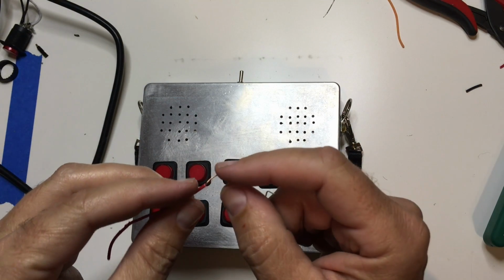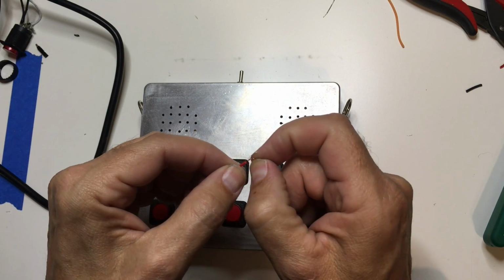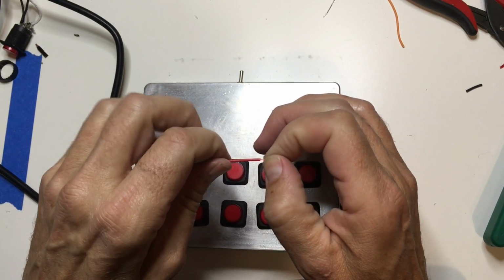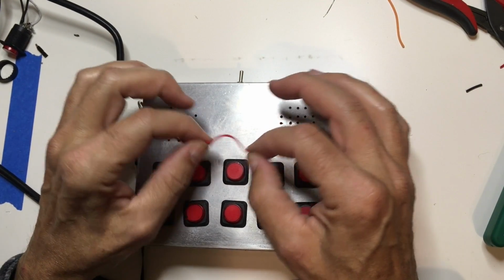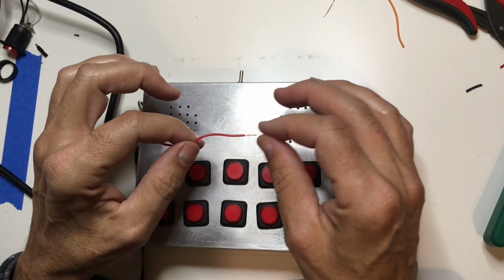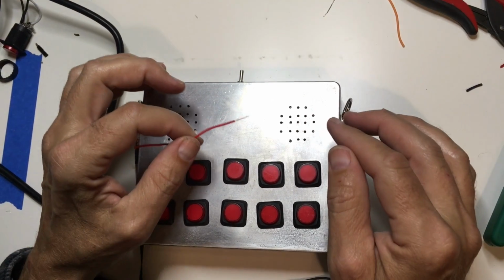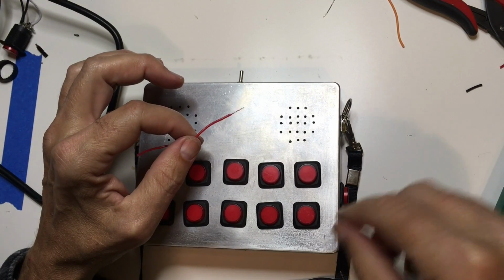See, is this some braided wire? Yeah, this is some braided wire. So braided wire is lots of little small pieces of wire which they braid together. So it's still pretty strong. But the nice thing about braided wire is it's really flexible. So if you need to move the wires around easily, braided wire is the way to go. The problem though is when you're soldering it, if you don't get all the braids tied down, the little braids will start sticking out and possibly short other ends of your switches. And that's what was happening because I was rushing it.